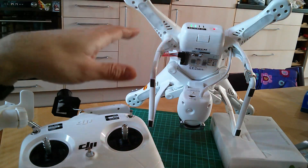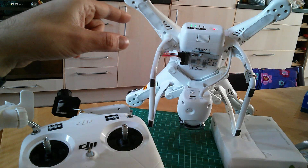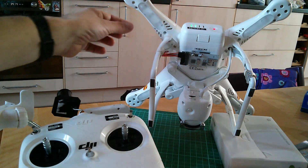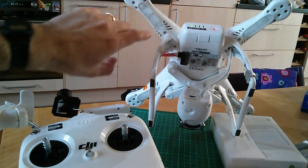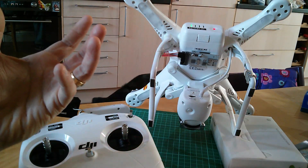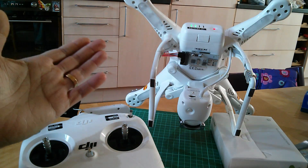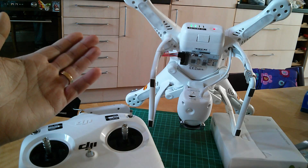Outside, when you get satellite lock, it means it's found a home position lock and is ready to fly. So you get green and then three reds. Three red flashes means you have fewer than five satellites locked — probably a bad idea to fly in that situation, although it is flyable, but it will only be in Atti mode because that's all it's got.